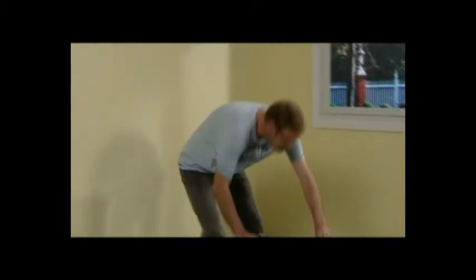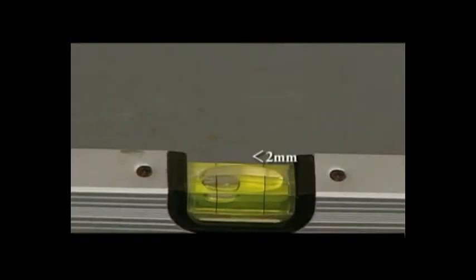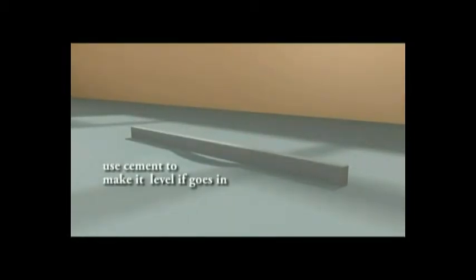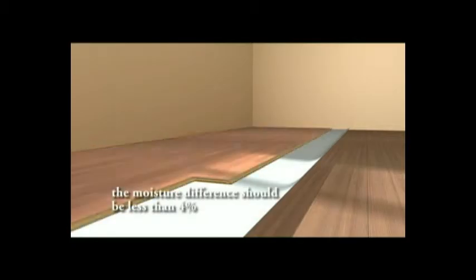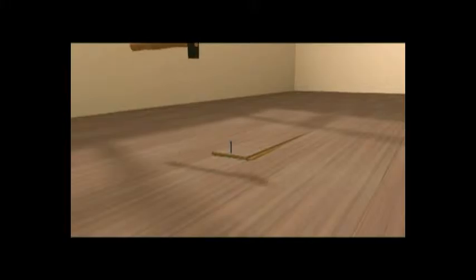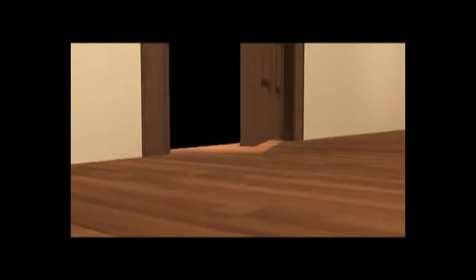Job site inspection. We should make an inspection of the room before installation. Firstly, the concrete floor needs to be smooth, clean, thoroughly dry and with no possibility of leaking water, and the uneven difference should be less than 2mm. If not, use the spade to make it smooth where it goes up, or use cement to make it level where it goes in. If you are ready to install a new floor upon existing wood floors, the moisture difference should be less than 4% and keep the crawl space under the wood floor sufficiently ventilated. Any loose parts must be nailed down and if necessary, a leveling underfloor must be installed. The door or door frame and the floor should have an approximate height difference of about 5mm.